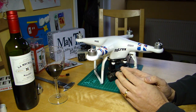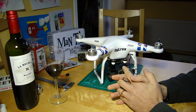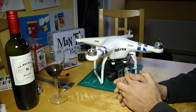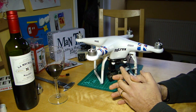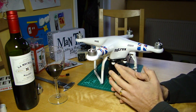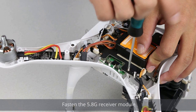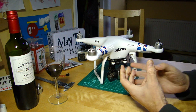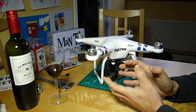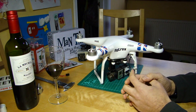It's the same technology built into the Inspire One. You used to be able to fit Lightbridge onto a Phantom without too much issue, but the problem was the Phantom transmitter would still be blasting out 2.4 gigahertz control signals, causing interference. So what you had to do was strip out the 2.4 receiver in your Phantom 2, replace it with a 5.8 receiver, and use a 5.8 controller. That involved surgery on the aircraft, which put a lot of people off.